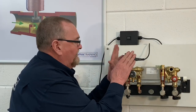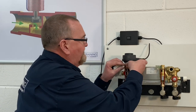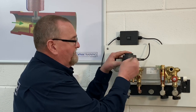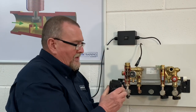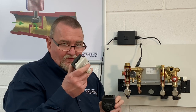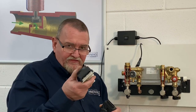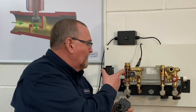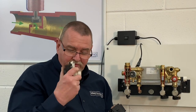When they brought in the bypass, they got rid of the old black head and brought out a black-and-white head. These heads are very easy to unclip — there's just a little clip and it pops out. There's a three-way plug with three connections: the middle ones are neutral and the outer two are both lives, because it motors down and motors back up. The new head is exactly the same electrically; the only difference is it's black and white, which signifies it is to be used with the bypass.